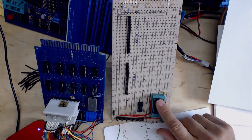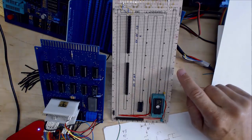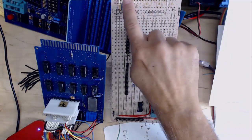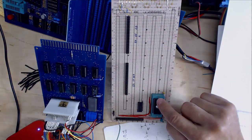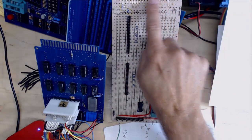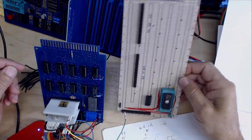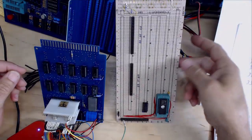When I did this, one thing I realized that didn't dawn on me before is I have 3 or 4 different computer systems that use this 2x22 card connector on the end, and all of them have the same configuration. When you're looking at the component side, you have the numbered pins down here and the lettered pins are on the back. I built this without thinking about that, besides, that's the way the vector says. This is the component side and that's the solder side on the other side.